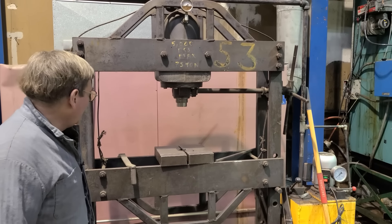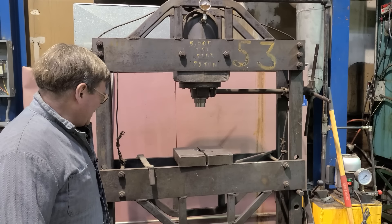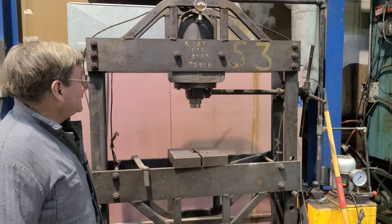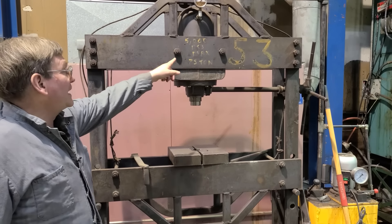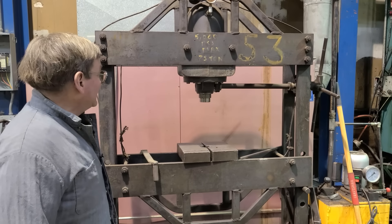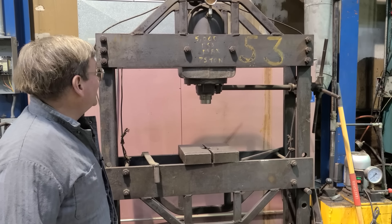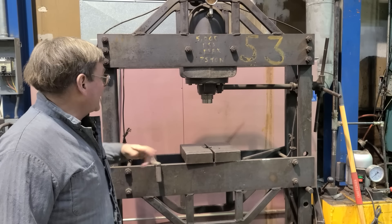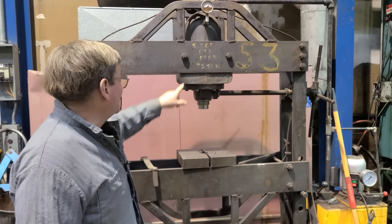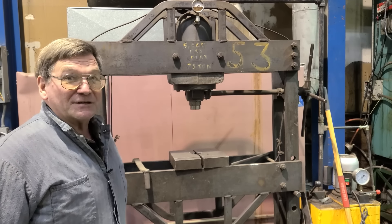Hydraulic press. It's pretty hard to give a number on it — I think I paid $750 for it. It is a 75-ton KR Wilson. It's 5,000 PSI as opposed to most newer hydraulic presses like this that run 10,000 PSI. I initially thought it was a 50-ton because in college we used one that looked similar, but I found a catalog and when we had it apart and resealed it we measured the bore size — that's the one they consider a 75-ton, which works out to 75 ton at 5,000 PSI, using the same pump.